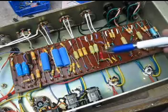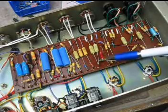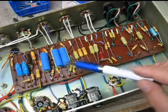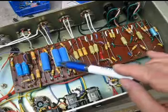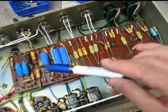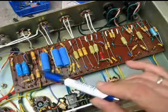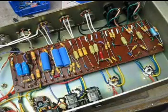You have the typical Fender values for the tone stack, 250 pF, 56K, a pair of .02s going to the tone controls. You only saw these caps for a brief period in 1969. I think they're made by Cornell Dublier. And typical Bassman JTM 45 values across the board here. 27K feedback resistor, everything pretty much the same as the Fender type schematic.